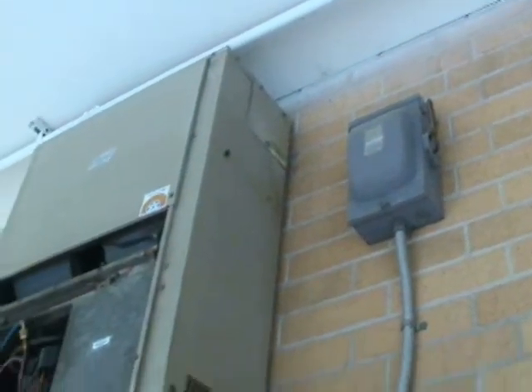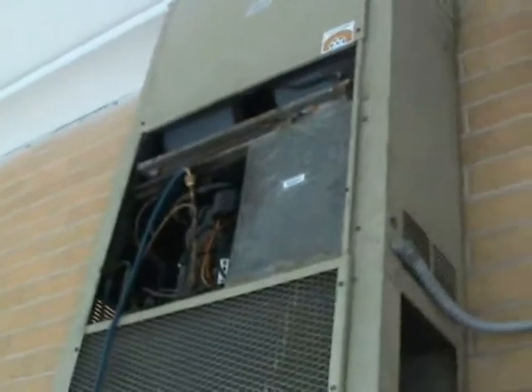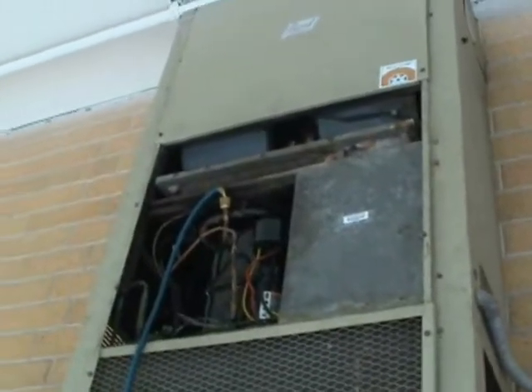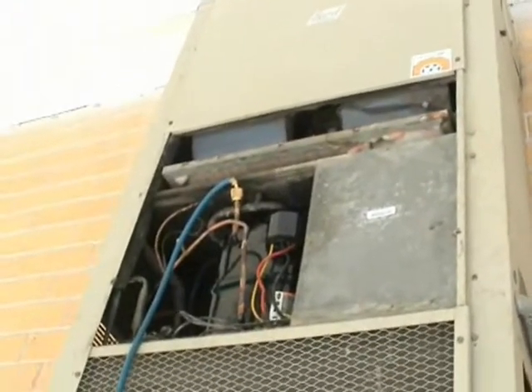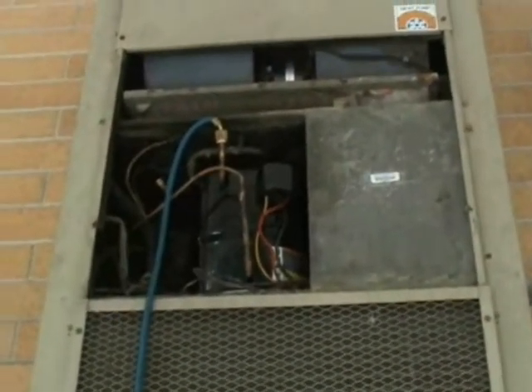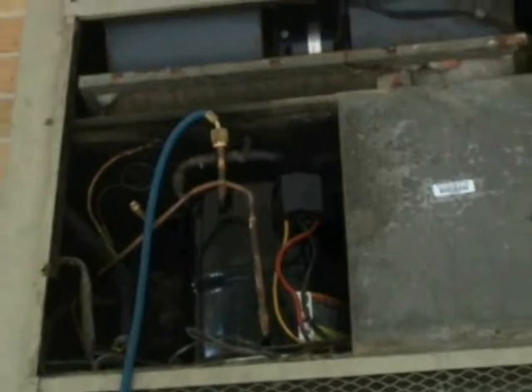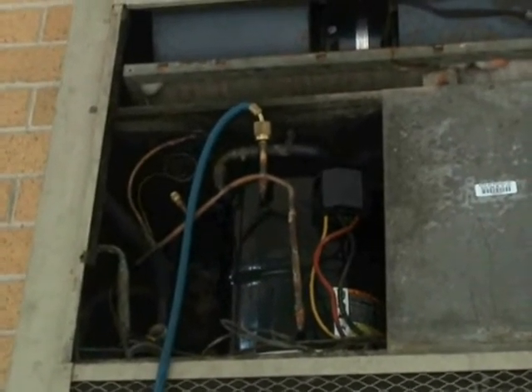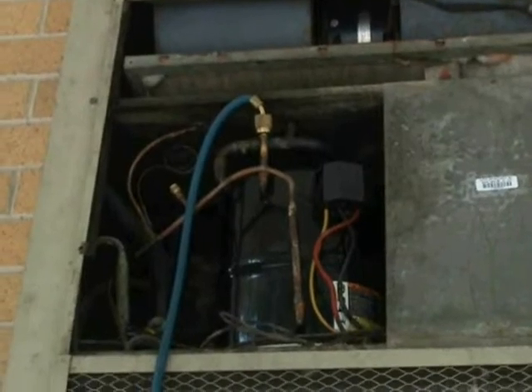We're ready to go — now we'll see how she runs. We still have the suction line hose on as we want to be able to clear all the liquid refrigerant out of the hoses while it's running. There we go — started up pretty good. And there it is folks, it's running. It looks good, it's running good. Everything is fine. And that's that.